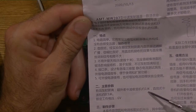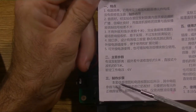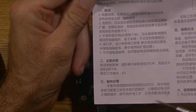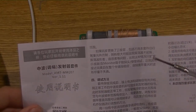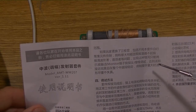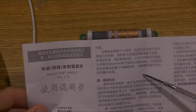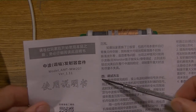Main parameters: Effective transmission distance — superheterodyne medium-wave radio is about one meter; direct-type medium-wave radio is about 0.5 meters. Rated working voltage: 6 volts. Assembly steps: The schematic diagram and circuit board diagram are shown later with component values and position numbers. As long as all components are properly soldered, it can work well. If the user changes the transistors for other component values, the oscillator may not vibrate, or can result in waveform distortion and poor sound quality — this can only be debugged with an oscilloscope connected to the monitor terminal to achieve a stable waveform across the entire medium-wave spectrum.